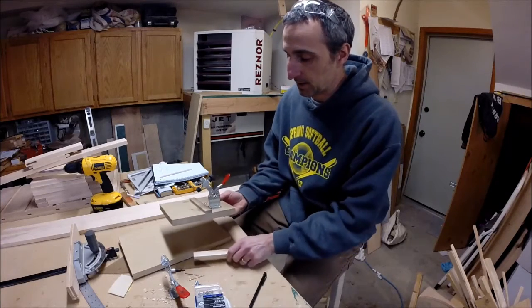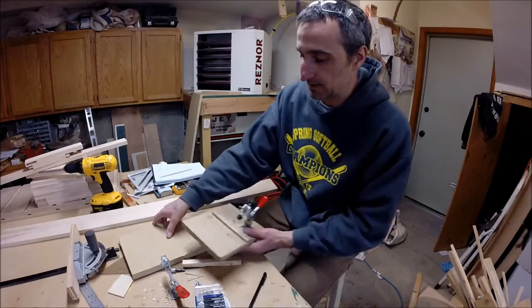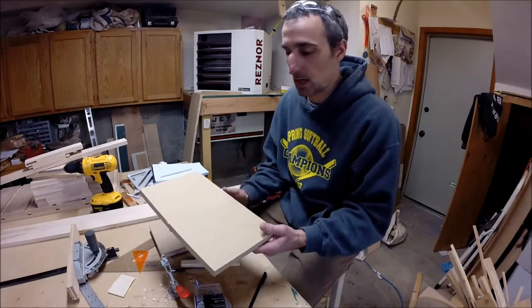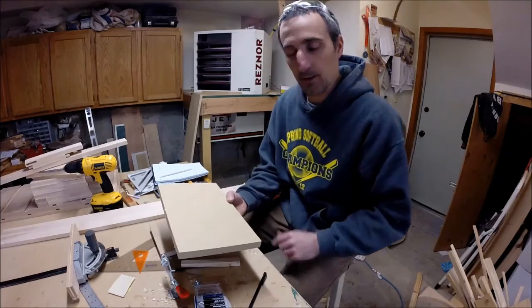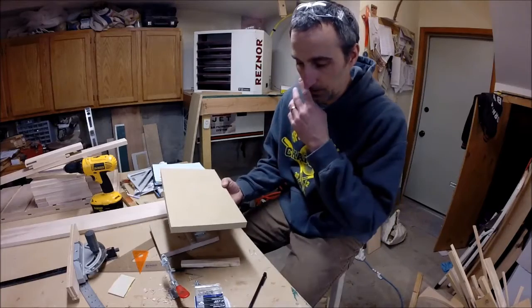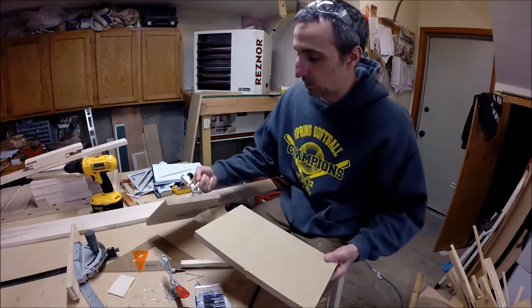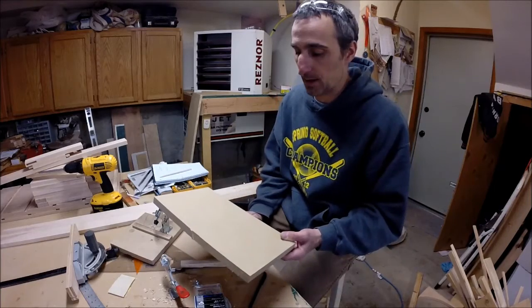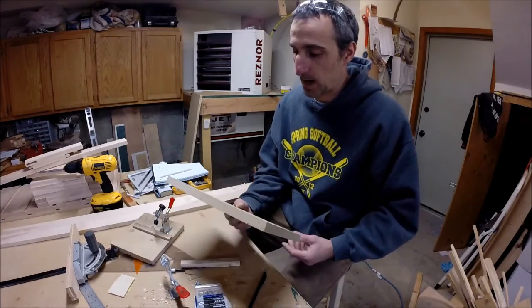The first thing I'm going to do is take this piece of MDF over to the table saw and cut it into about an eight-by-eight square. Depending on your bandsaw or your needs you can lengthen or shorten the jig. Let's get started — we'll head over to the table saw and cut the top piece to the proper size.